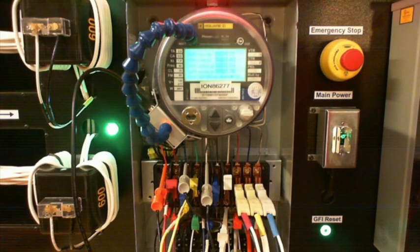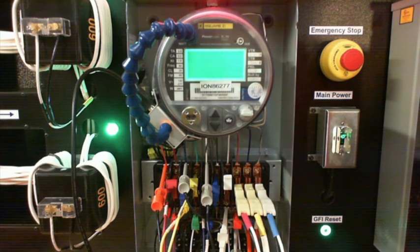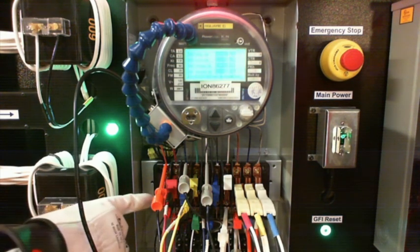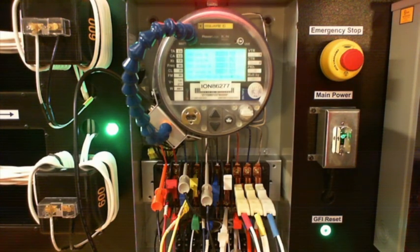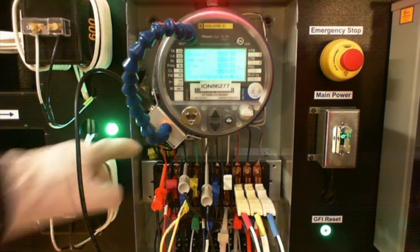Okay. Cool. While that light load's running, I just want to talk about this one more time on these connections, because this is where a field guy just like y'all. So when we get out there and start putting these jumpers on, with this one being a little bit odd, and I've got my returns over here and my shunts way over here, I just want everybody to keep in mind, you're going on the same phase. You're going to connect at the bottom of the return blade and the top of the shunt blade.